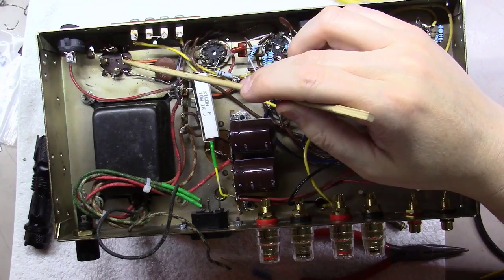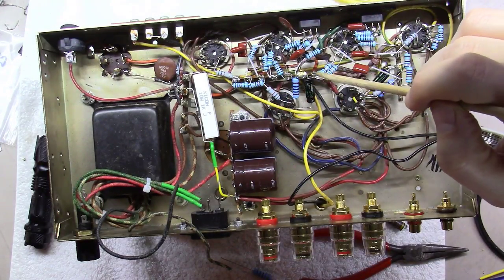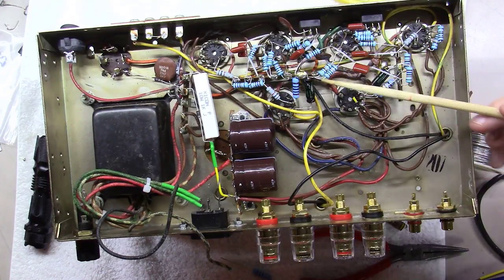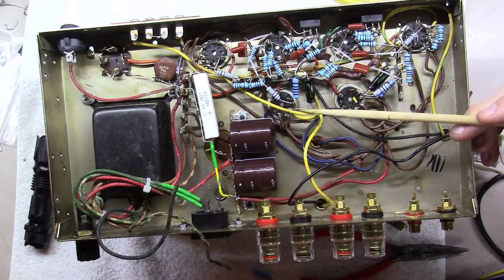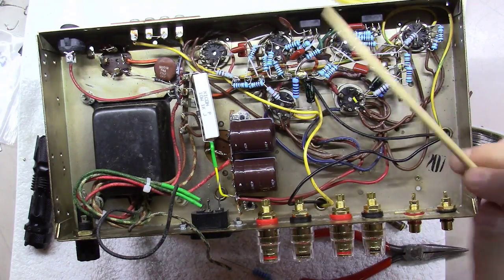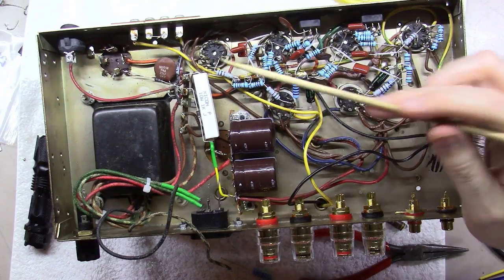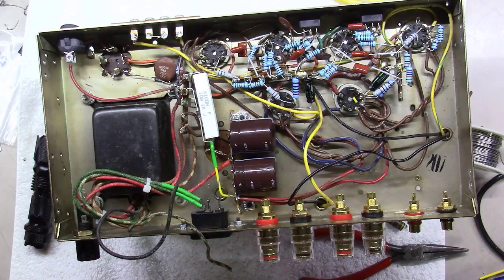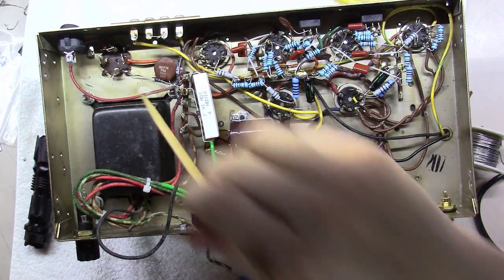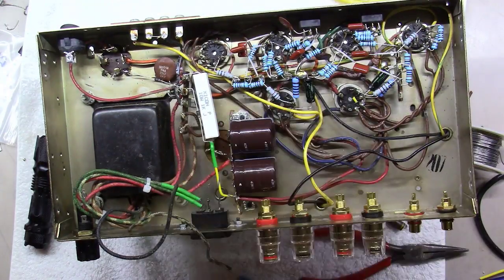And then if you come off of this one and follow the orange wire around, it comes to right here. And all it needs to do is go between here and ground. And by the way, this tab is ground. So if I can tie another 4700 ohm resistor right here, then all I have to do is between the two positive leads of these, between this one and this one, I need to tie a new 3-watt 4700 ohm resistor. So I can get out of this space over here altogether and get rid of all these wires running around.